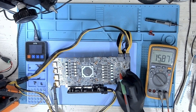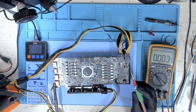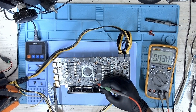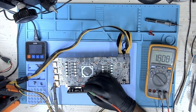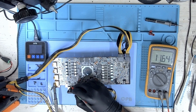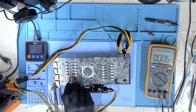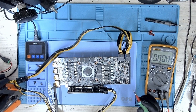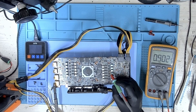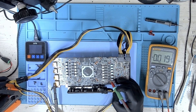It's time to measure the voltages. Let's start off with the 12 volts — we have 12 volts coming in. Let's check the 6-pin — we have 12 volts coming in on this one as well. SOC — we have SOC. 1.8V — we have 1.8V. 12 volt PCIe — we have 12 volt PCIe. Core — we have core. Memory — we have memory on all rails. So all voltages are present.